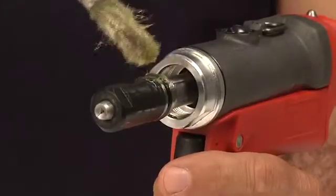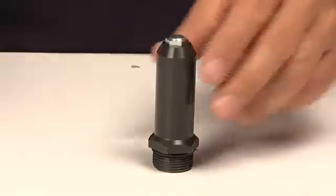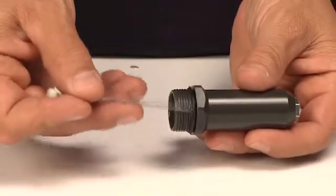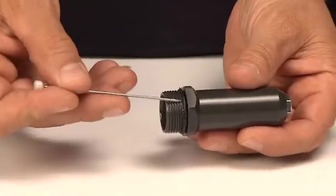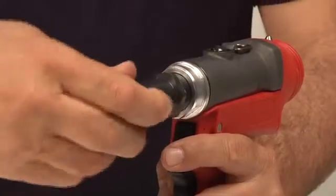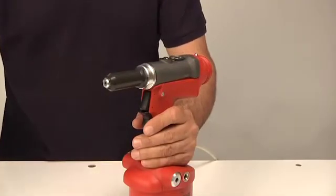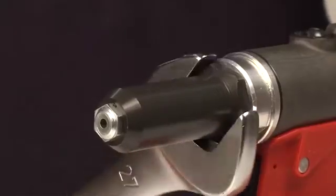Apply Panel special grease 2 to the cone holder head unit, in particular, the gasket. Check the conditions of the sleeve carrying nozzle, in particular the threads and O-ring gasket. Replace any damaged part. Tighten the sleeve carrying nozzle onto the front connector, locking it using a 27mm wrench.